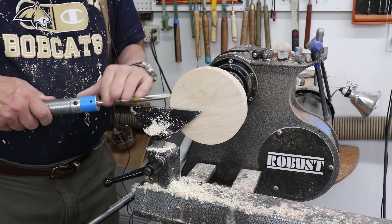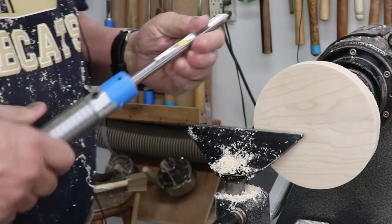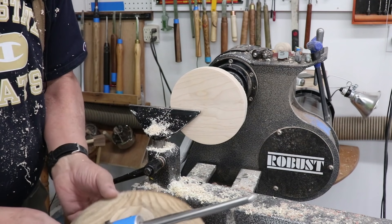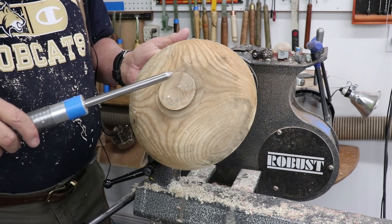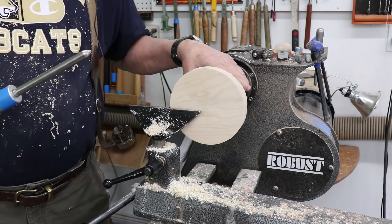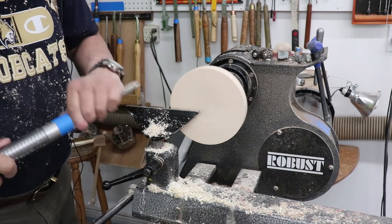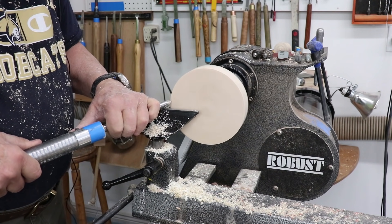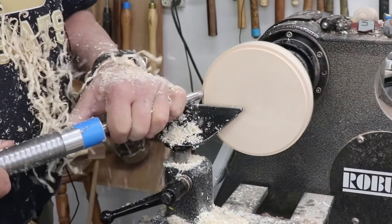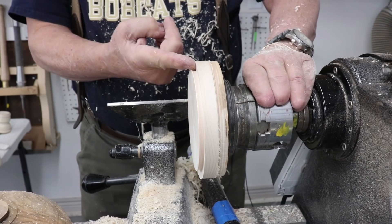I'm not going to go into the wood in this direction because I'm going to be hitting end grain. I'm going to be going right here, and that's cutting across the grain — same thing with my bowl. When I get to that point, this is cross grain, so I would approach it in a similar manner. This surface right here — I call it a flat spot — your chuck jaws need to connect right there and it has to be perfectly flat.